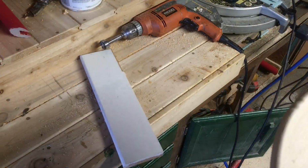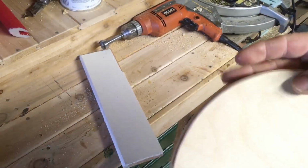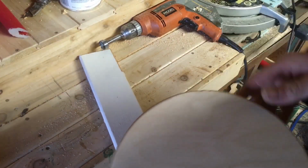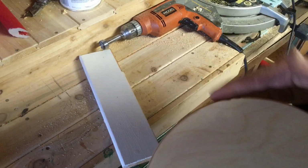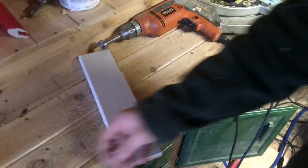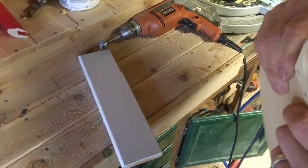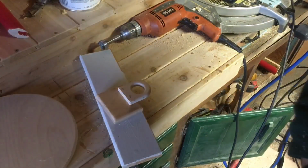Now, all the boards that I get have a little groove right on the very top of them because they're coming out of a CNC machine. They're the fall-offs off of a CNC, so they always have that little groove. So I make that the very top of my piece. Now, if you're cutting these with a scroll saw or band saw, you won't have this. But this is just a pain that I get them this way, but they're throwing them away, so I can't complain, and I love it because I always need circles. And I hate cutting circles. If I can find a way to use them without having to deal with that, I usually just cut around it, recut them when I get home. But so now I'm going to CA glue that, and we're going to nail it. So stand by.